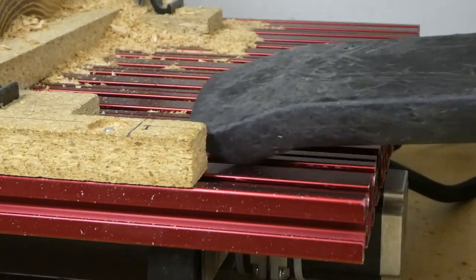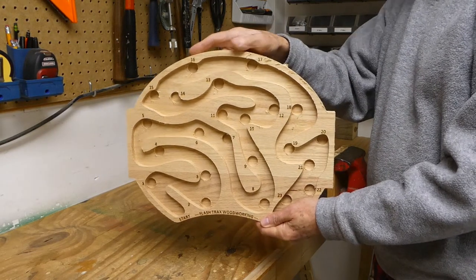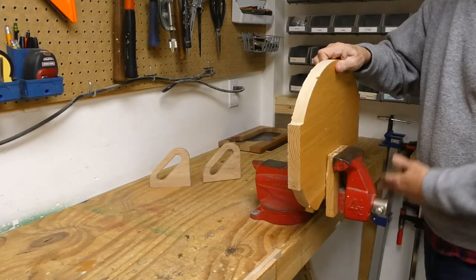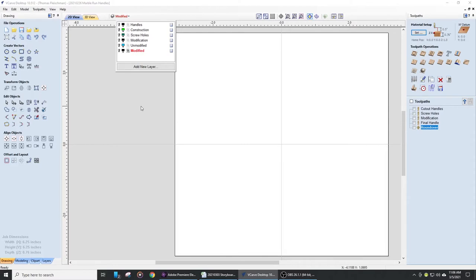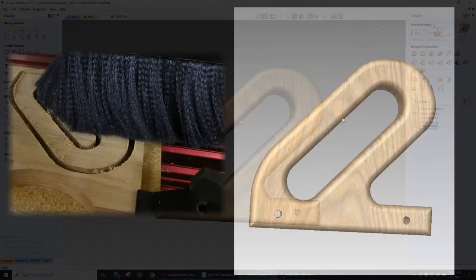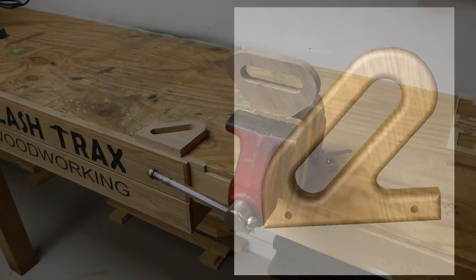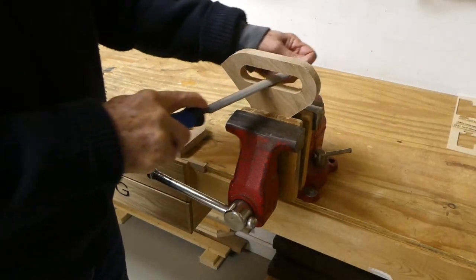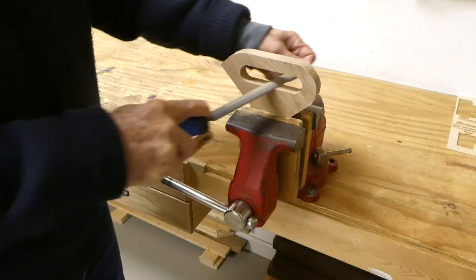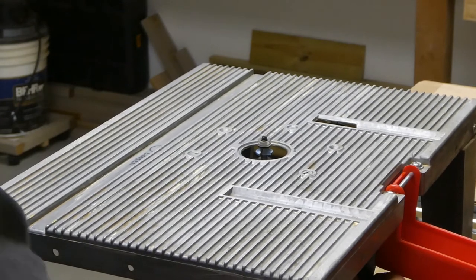After a quick cleanup of the chips, here's a look at the project so far, over by the bench vise, where I'll use a flat file to clean up the tabs left from the final boundary cutting operation. The marble run game could be played by bending your wrists to hold the board flat, but I decided to add handles oriented at about a 45 degree angle with a one inch opening for more comfort while playing. Here's what the drawing looks like in 2D, and in 3D we can see the completed handle being rendered. Just as with the main board, I need to file some tabs after the handles are cut out on the CNC machine, and I'll add a round-over using a router table with the round-over bit, since I need to access both sides of the handle anyway.